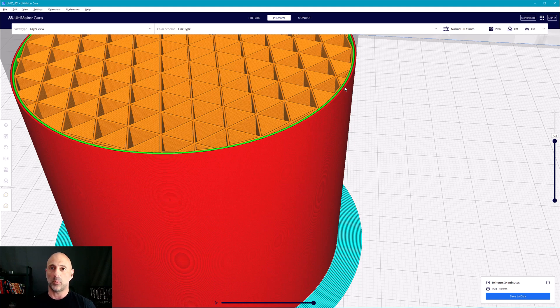That isn't anything anybody in the industry is doing wrong — it's just old technology. Stereo lithography files, STLs, were introduced sometime in the 80s and they haven't changed. Maybe the format of the STLs changed and different scanners produce different output, but STLs are fundamentally the same. It's basically a tessellation — almost like draping something over the shape and tucking it in, like a foil or cling wrap, and then making something based on that. The tessellation doesn't have the true geometrical elements of the shape.